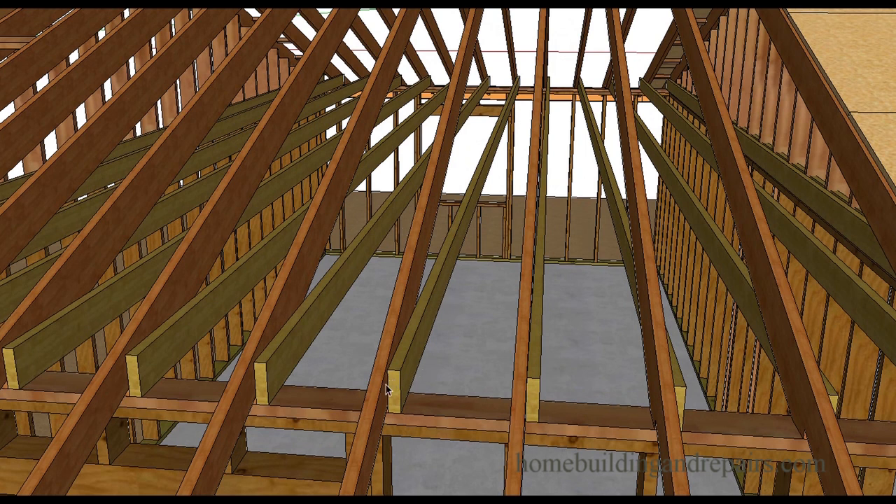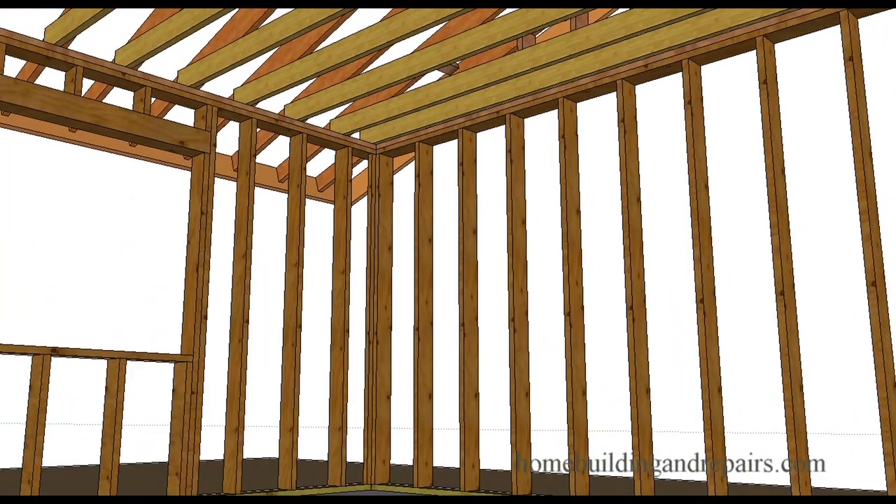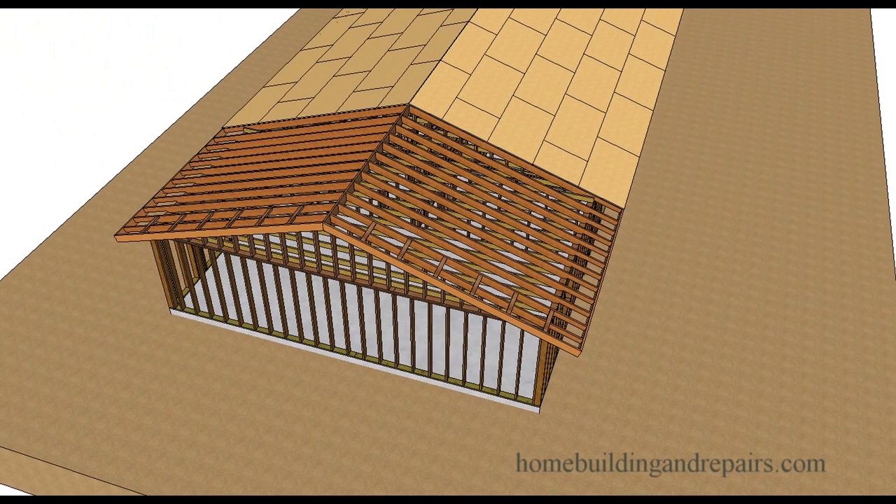Ceiling joist tying into the roof rafter - that's a must, probably three or four 16D nails going into it. Two toe nails into the top plates. Don't forget to tie the plates in - it will require some type of strap, usually a 48-inch long strap. These videos are just to give you an idea on how to do this stuff. I'm going to make a part two video that will provide more information on how to tie the plywood in or use straps to make the structural engineers happy.